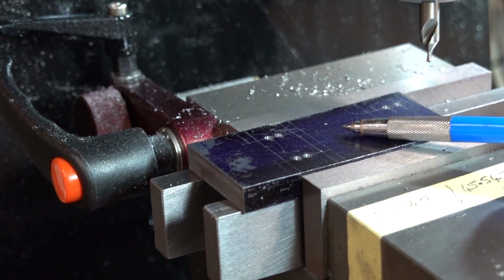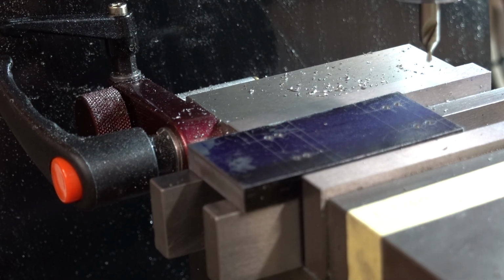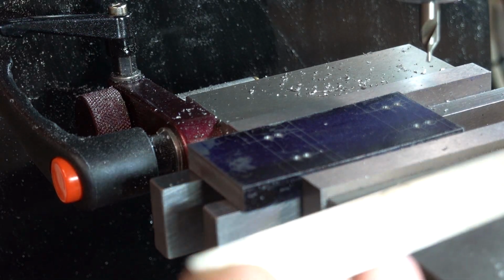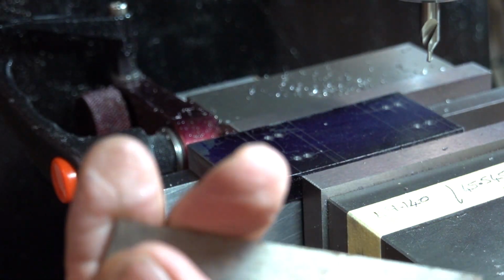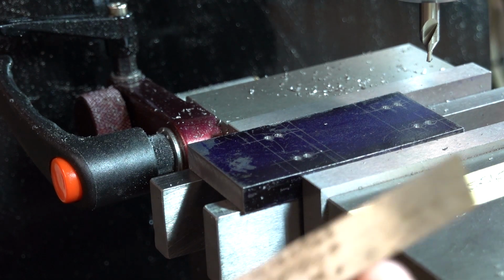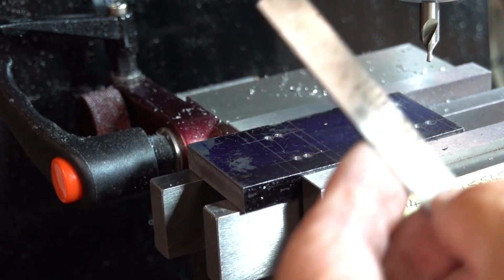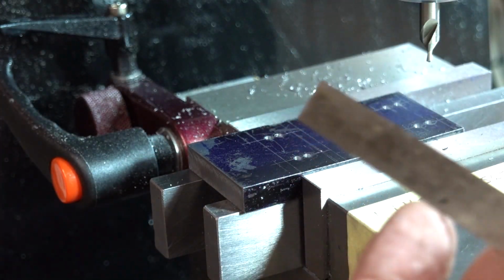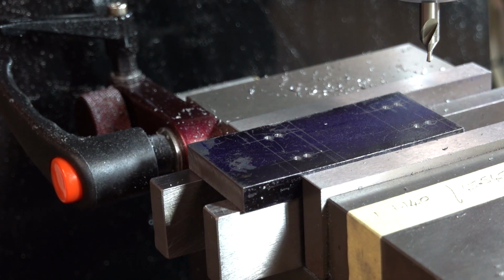I am going to make another one of these, and I'll show you why. I've got another piece of spare steel, and I've got loads of these little dinky blades. If you can read that, BSA Tools Limited. I'm taking it they must be fairly old. High speed steel parting off blades, little dinky ones. So I'm going to make another plate so that I can sandwich a smaller one of those to the block without using the same one. I'll just swap them over, because if you remember I did have two spare pieces of this over when I cut the block up, so why not use it?